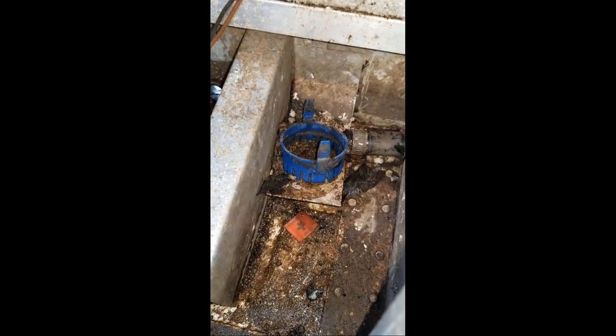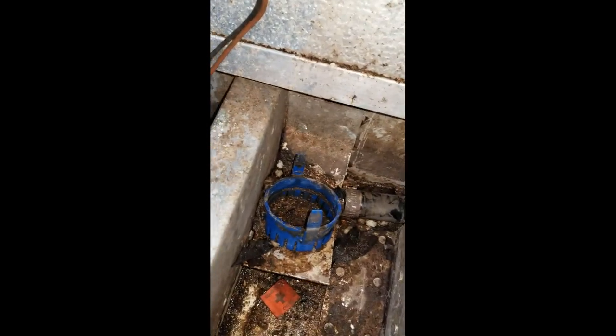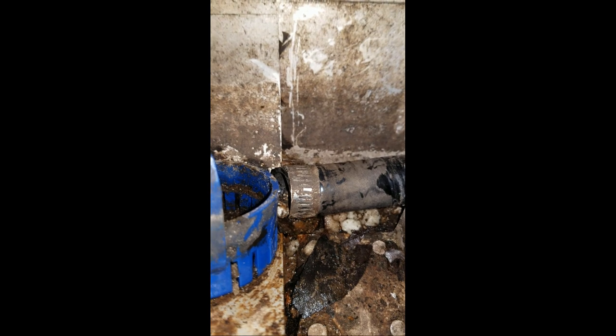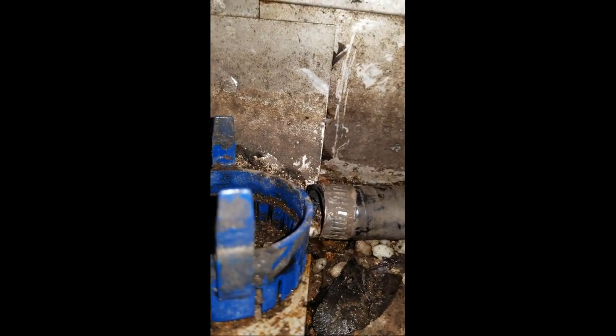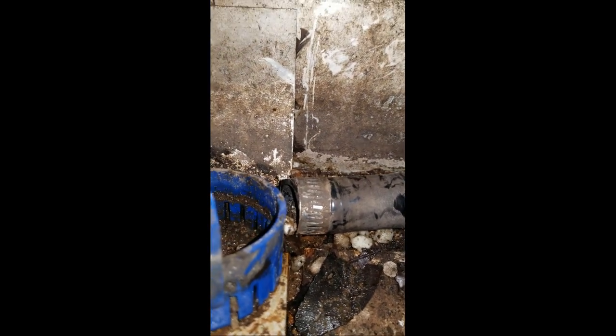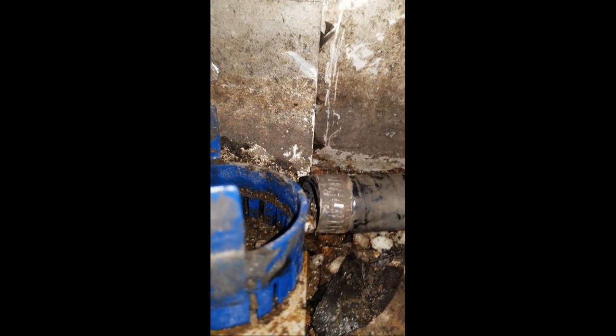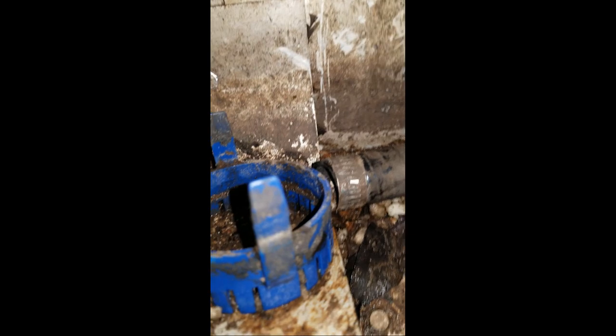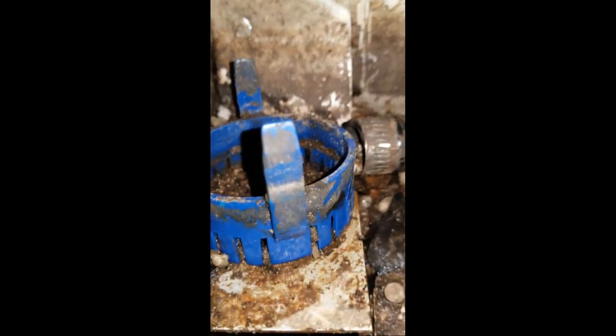There's the bottom part of the old pump, and there is the three-quarter inch hose. I've got a hose clamp on my hose with nothing — it's not attached to anything. But the piece of that hose fitting is still in there. There's no more slack on that hose. You see that — it looks like a nail? Well, that's the back side of a rivet. This pump is mounted to a piece of aluminum, a thin aluminum bracket that is riveted to the inside of the transom.